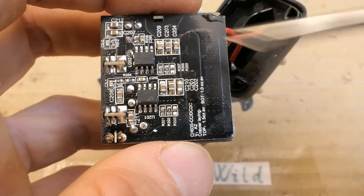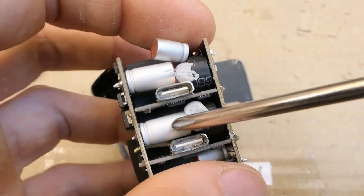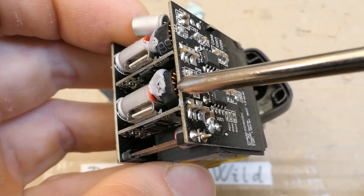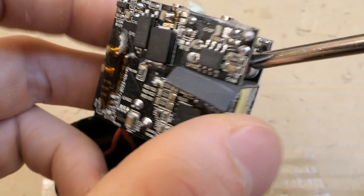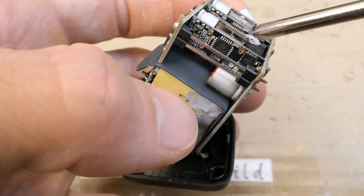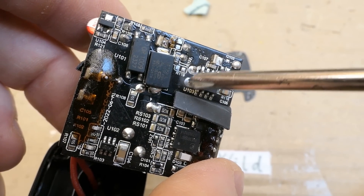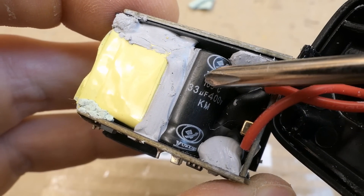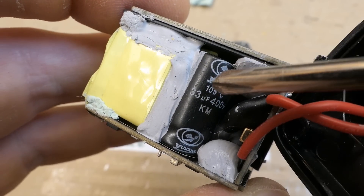There are a lot of capacitors here. Here are probably the smoothing capacitors on the secondary side, the ports, some inductors under these covers, some interconnection between the boards, and more chips — maybe for communication, and some transistors switching the voltage. The secondary of the transformer seems to go here, which makes sense if this is the synchronous rectifier chip. The primary smoothing capacitor is rated for 105°C, but loaded at full 40W it was actually hotter than this — at least 11 degrees over, and probably even hotter when still enclosed.